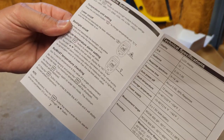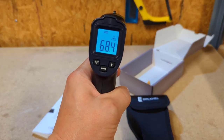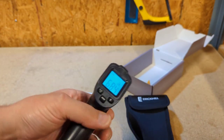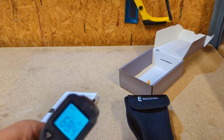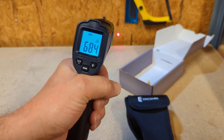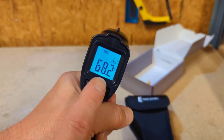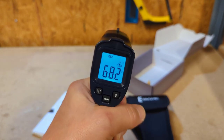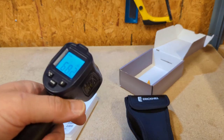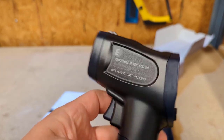I just use it to scan and take a temperature. It's good for checking the temperature — maybe you want to show a resident or customer cold air coming out of the vents, that the AC is working properly. Hold it up to the register to show them it's 50 degrees coming out, or if it's not working and the room is 68 degrees and the display shows 68, you know the AC is not cooling properly. You can also check the temperature of whatever you're cooking. So it's good for multiple uses — it's going to come in handy.